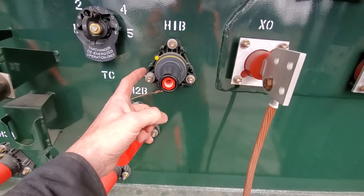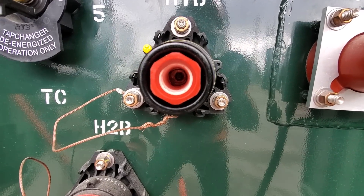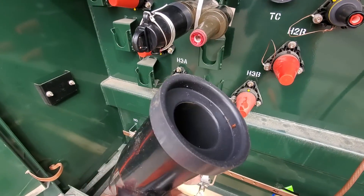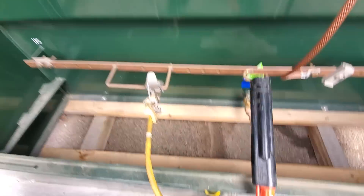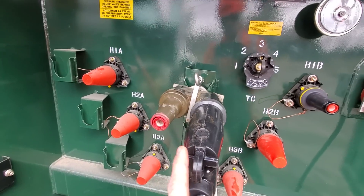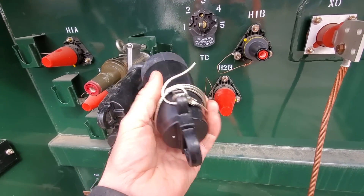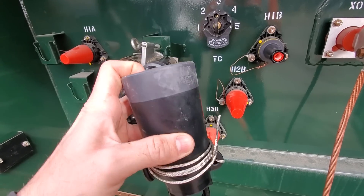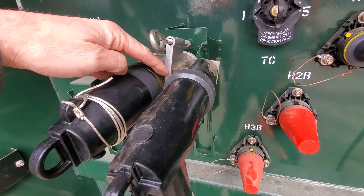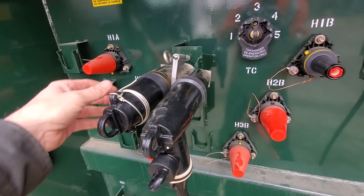The last thing I want to cover: when these are exposed you can see the manufacturer dust caps — quite dusty. You don't want debris or foreign objects getting inside that connection at all. You don't want it inside your elbow and you don't want it inside your parking stands. You cannot have an exposed bushing like that. If all you have on the truck is a double parking stand, you can't plug this in and leave the other side open, so you're going to have to use one of these bushing covers. These bushing covers have some semi-conductive material in there along with insulating material. If left isolated like that, you could see a little bit of arcing going to ground — that's pretty normal, however that arcing can start to pit the rubber and cause damage.